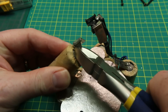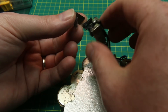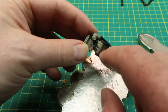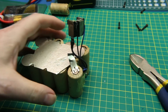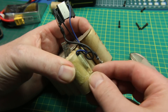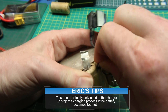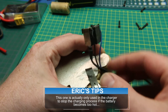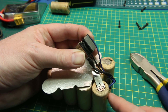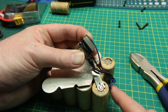I'm going to go ahead and snip this with my side cutters, and then we'll get our tab back. This tab we're going to need because this is our positive side. Positive, negative. There's also a thermistor or a temperature-activated switch of some form in here to make sure that the drill powers down if the battery becomes too hot. Now we just need to check and see whether — you know what, we can just leave this in. If we make this permanent we can just stick this to the side of our LiPo and keep that safety intact.